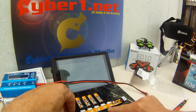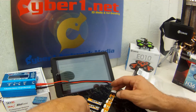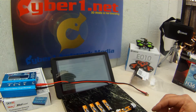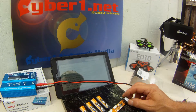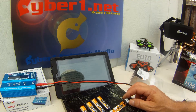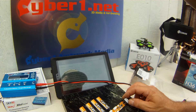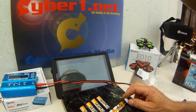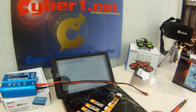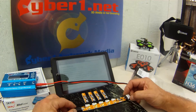I'm putting on my specs to read the labels. These are current selector switches — it's not a battery identifier, it's a current selector. The default top position is set to 500mA; in the down position they're at 200mA. So down is slow charge, up is fast charge.